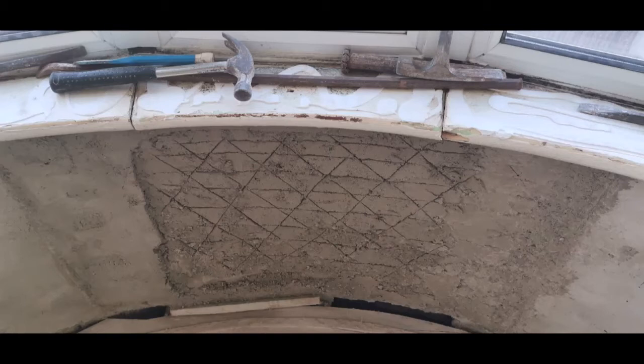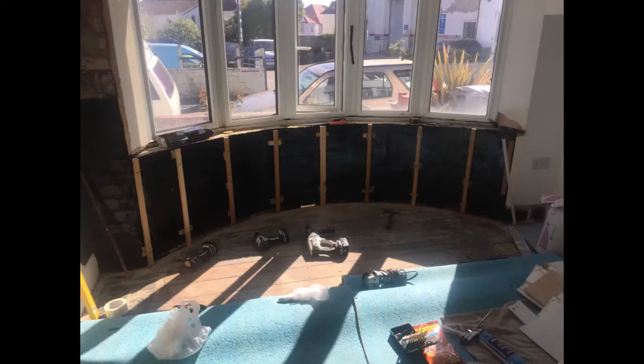I managed to get a good coat all the way round — certainly good enough to apply a coat of blackjack, which finally waterproofed the whole area. The wall is now fully rendered and waterproofed using blackjack, and I've battened off the wall ready for the plasterboard, starting at the centre and working outward at 400mm centres. I attached the plasterboard to the battens and sealed around the edges with expanding foam, creating small cavities for each section. It's actually made the room a lot warmer — I'm really glad I did that.